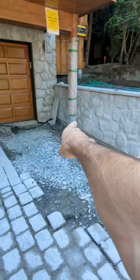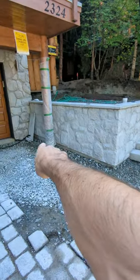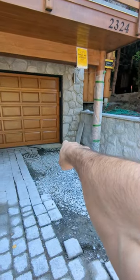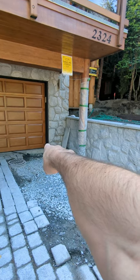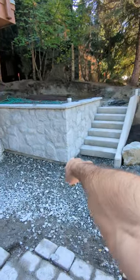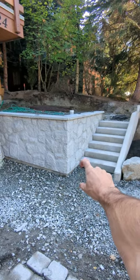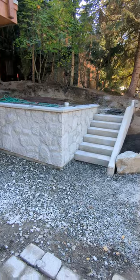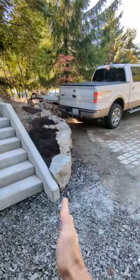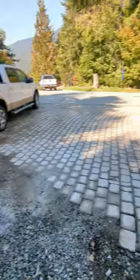There's a slope from the slab down this way and we're somewhere in the three-quarter inch range below angle iron. Over there we're probably going to need to either cut the stone on the wall or scribe our pavers around it — not sure what's going to be easier. In here they'll just tuck into the base of that lower tread, and you'll see a bit of a reveal on it. We should do a nice soldier course along there — no need to scribe, just do a soldier course around and into there.